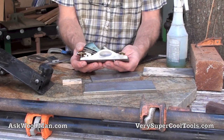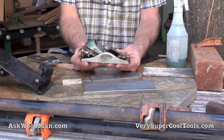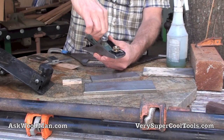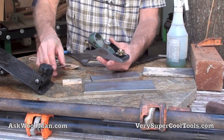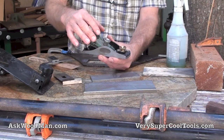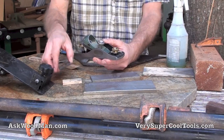What I've got here is my new block plane — actually probably from the 60s or 70s, I got it on eBay, the first thing I've ever bought off eBay. I have my Hock replacement blade in this. The block plane I bought had a lever cap arrangement that worked fine with the original blade that had the smooth top, but my Hock blade has holes that go all the way through, so the little lever mechanism would fall into the holes and just didn't work right. So I modified the block plane by adding my own new post, taking the old knob off my old block plane, and just using this pinch-down cap — and it works really well.